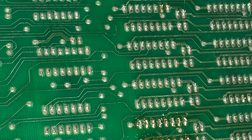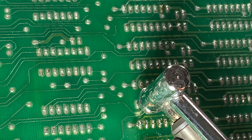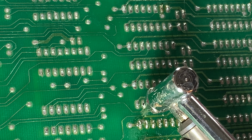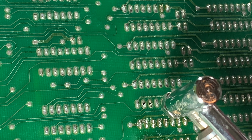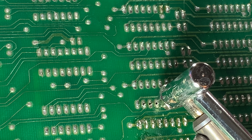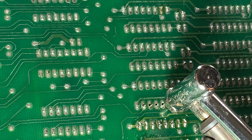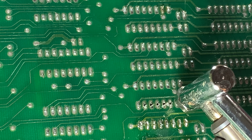You know what? I might go left-handed. So we squeeze the ball. I'm going to do not one of the corner ones first. And the solder does seem to be coming out nicely. I'm going to do something that I should probably do anyway, and that is try and give each pin a little push towards the center on the first suction operation.